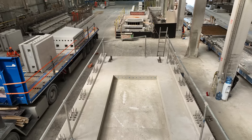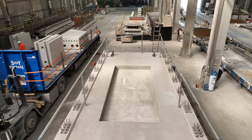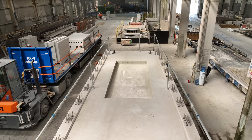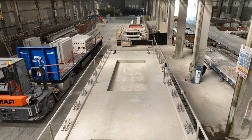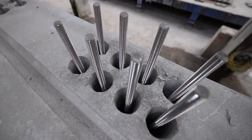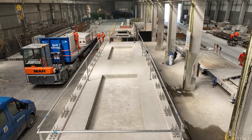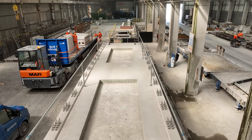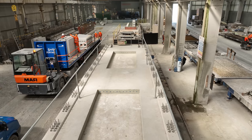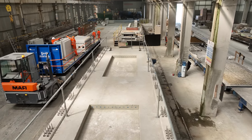We got this polystyrene laser cut to the shape and geometry required to fit in the cage with the cover. It was then locked in place with spacers and additional reinforcement, and the couplers there will facilitate the guys inside tying reinforcement and stitching it back in to finish. On top of the deck you get the bolt clusters bolted on for the fencing, with some flexibility where you've got holes and voids formed around the actual bolt. The polystyrene is about a metre thick — cut from a one-metre by 2.4-metre block. That was bought in externally as it's easier.